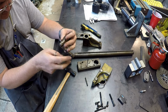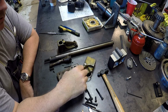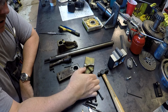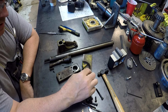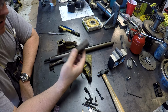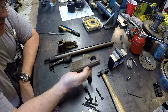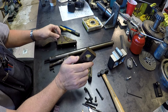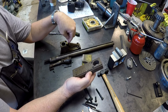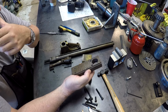This is worn significantly. All right, so I did a little searching around on the web. Went to the Wahlstrom website, and I will provide a link below. The Wahlstrom website is the company that currently sells the float lock vise. So this does not appear to be a factory part. So the factory jaws, at least through my limited research, are both the style that were on the fixed jaw, that were moving jaws with the 2 V grooves. So this does not appear to be a factory piece.